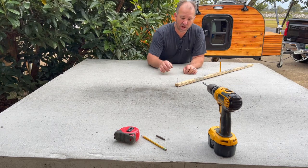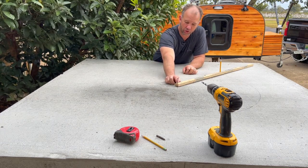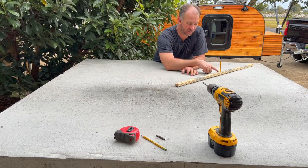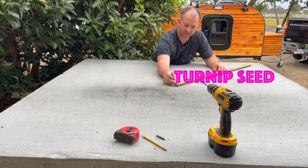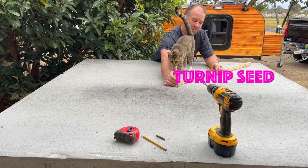I did this for the pattern. I took a piece of scrap board, measured 21 inches, put a screw in one end, measured 21 inches, and took a drill bit the same size as my pencil and drilled a hole in the board. The tip of this screw is just long enough to where it touches the concrete — so that it doesn't go into the concrete, it just kind of anchors itself on the concrete.